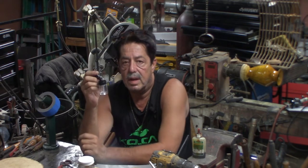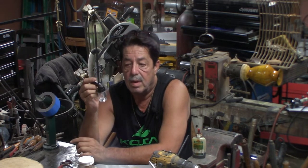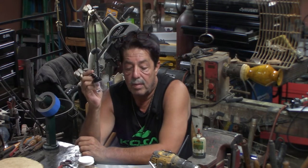But I would tell you, I leave mine now around 30, 35 PSI. I just play with this, and for brushing lacquer thinner, I get a really good result. It's a really good setup. And then we'll go over the cleaning of it in a little bit, but I'll do a demo for you here in a bit, and I'll show you what I mean.